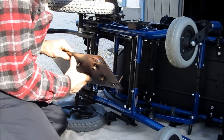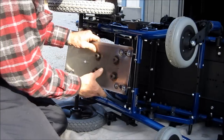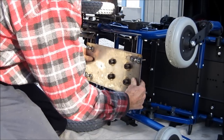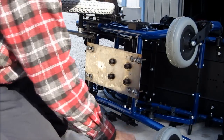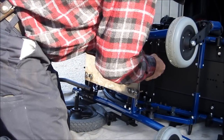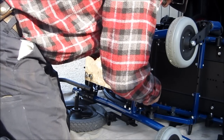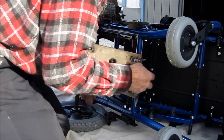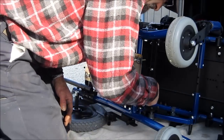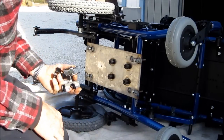This is the front. These holes here I cut out so that they would actually go around these four nuts and add shear strength in case of an impact. And then these horseshoes are a little snug — I didn't check them after I did the welding. I'm going to take a little bit off of these surfaces here. I don't want to drag them on and scratch the paint.